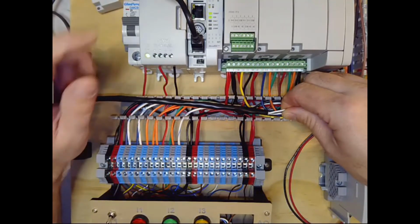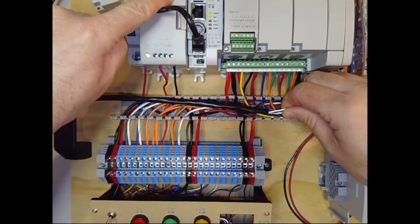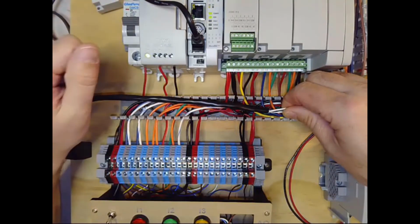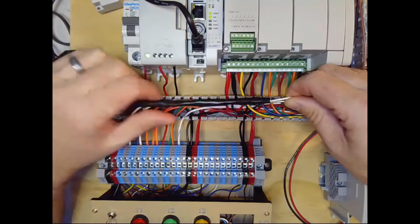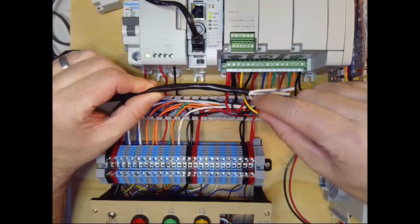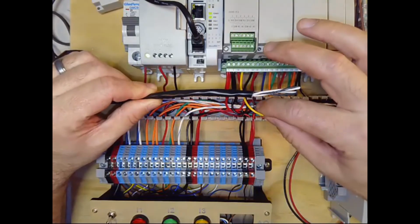The only place that really has a ground on the panel right now is the ground terminal of the power supply, and it's getting its ground through the 3rd prong of the power supply back into the building wiring system. So we actually are not going to tie our shield wire to anything in this case, but just know that typically that's where you would be landing it, on a metal panel.